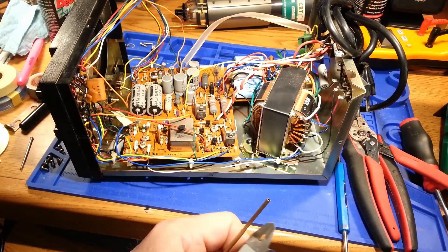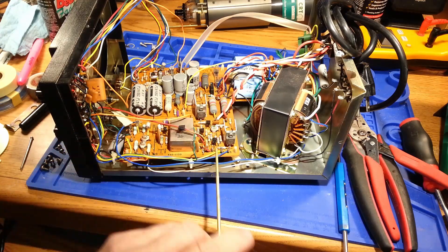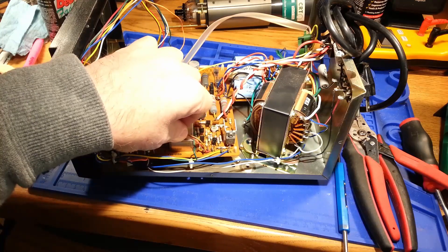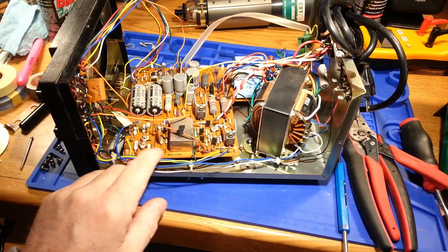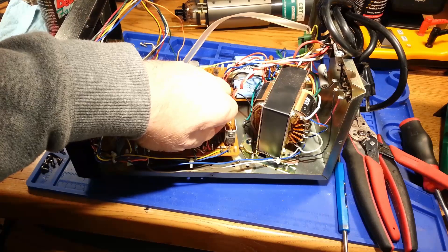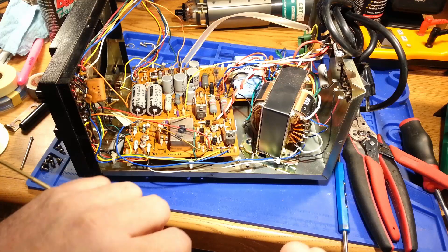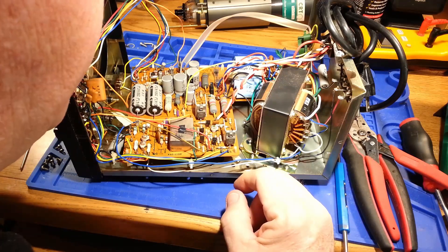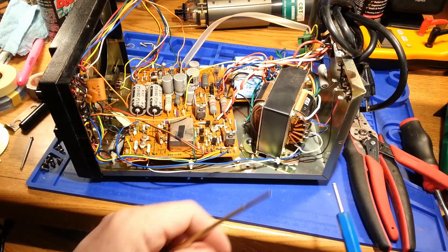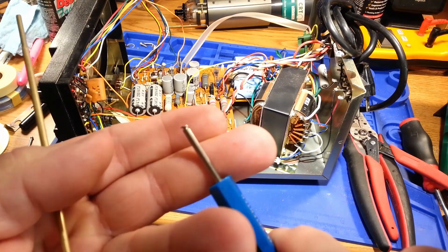What you can do is make up a tool fairly quickly that will enable you to remove these wire wrap connections and not let them expand too much, so you can almost reuse them intact just by sliding them back on. I'm choosing to remove these two wires just to get some more flexibility for repositioning this board for removing components. These are spiraled on in a clockwise direction, so to remove them you're going to need a tool that grabs them in a counterclockwise direction, such as this one. This tip will kind of rotate in a counterclockwise direction when it grabs it.